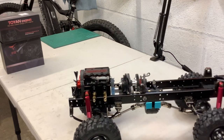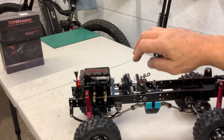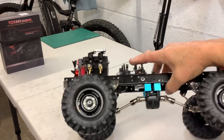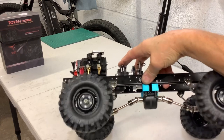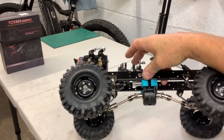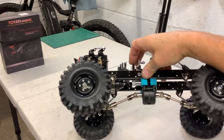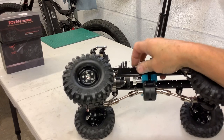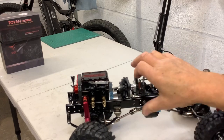This engine is only going to run to 13,500 revs, so it's not going to be very fast. I thought I want it a little bit quicker — this is a big gear driving the small one, so obviously it's geared up. I think it's going to be fairly fast with that gearing. But if I don't like it, I can always swap it about and change the spurs and pinion gear.